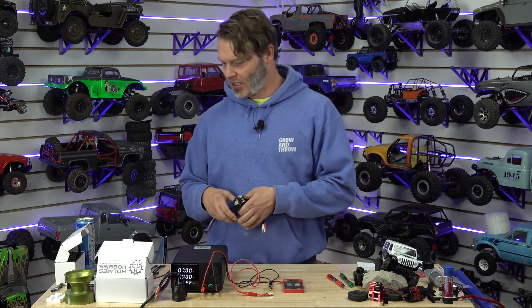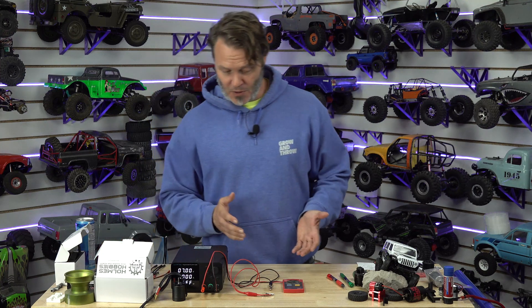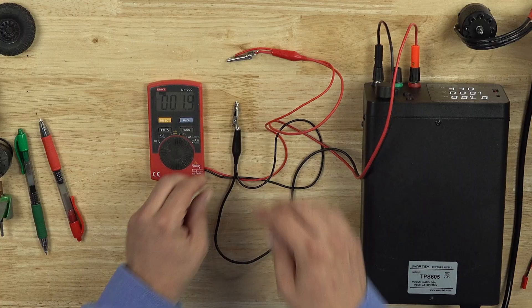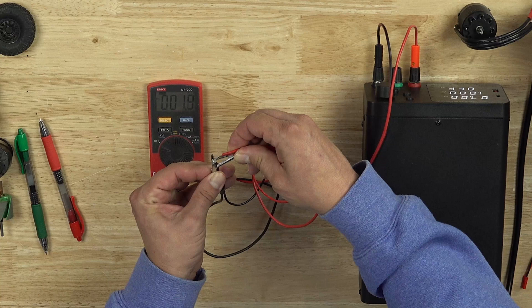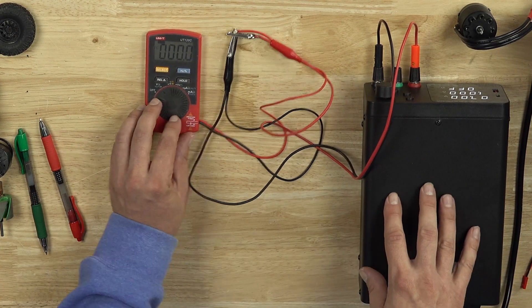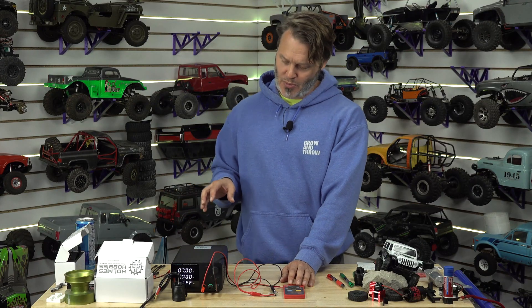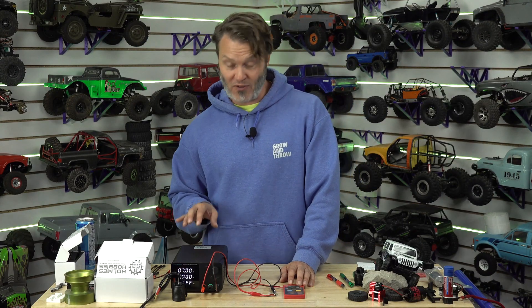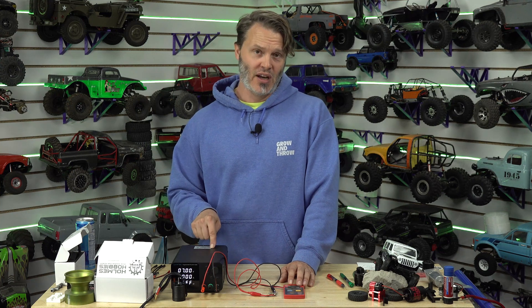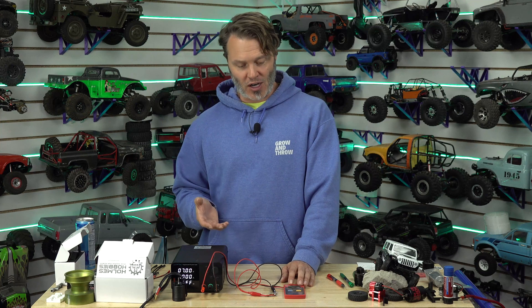But that doesn't really tell us enough information to make conclusions. This is a lot of motor. So you can see how I measured the milli-ohm resistance of these motors — very small values — using this Kelvin wire setup. Very inexpensive. This power supply may have been a little on the more expensive side, but it has a very wide voltage range — this is a 60-volt unit.